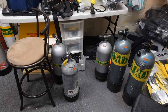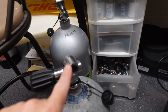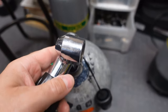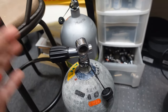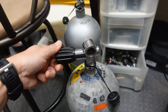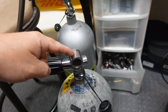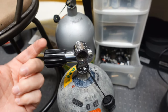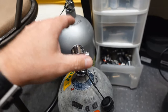Well, in short, it's the valve. If we take a close look at this valve here — don't pay too much attention to DIN versus yoke or whether it's 200 versus 300 bar. Just look at the design itself. You've got an outlet or what we call an orifice and you've got an on and off knob — nothing fancy. Because it is either going to be DIN versus yoke, we understand that it is designed for scuba use — air, nitrox, trimix, heliox, whatever. It's designed for scuba use.